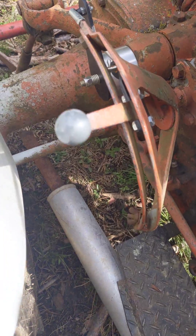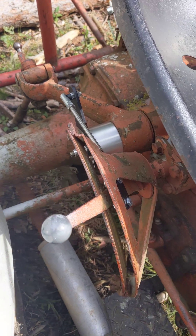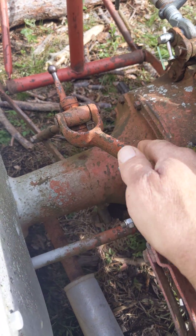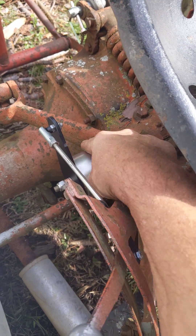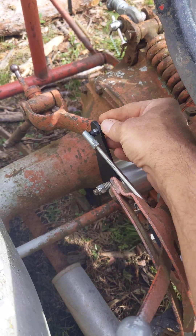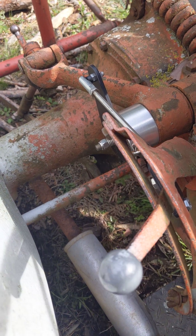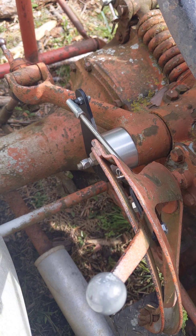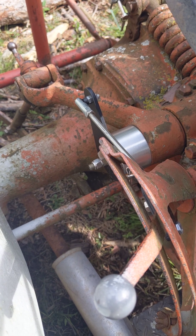What this does is you move your control lever here and as you move your control lever, it raises and lowers the arms. Now you have this little device here — this is a friction pad. This turns, so when this arm goes up, this arm goes forward, pushes the handle back down. When the arms go down, it pulls the handle upward. It finds a nice equilibrium — the position control stays exactly where you put it.